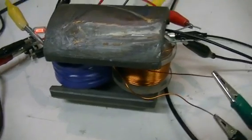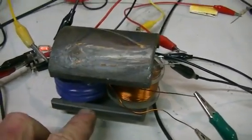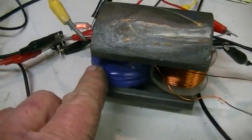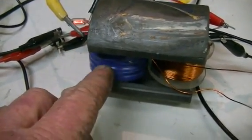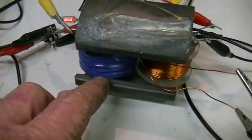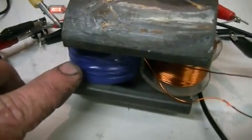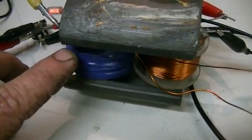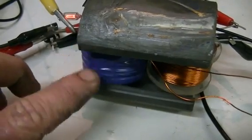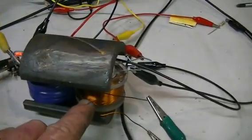Okay, two big magnets. The coil with the blue wrapping around it is a bifilar coil. The one we're using as our primary has two ohms of resistance across it, and one of our secondaries also has two ohms resistance - not getting into millihenrys and all that. This coil here is sandwiched between these two very large magnets, which are out of one of those motors.